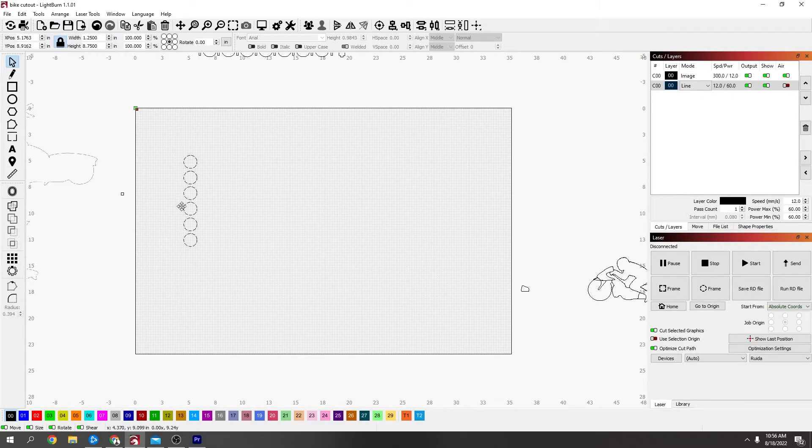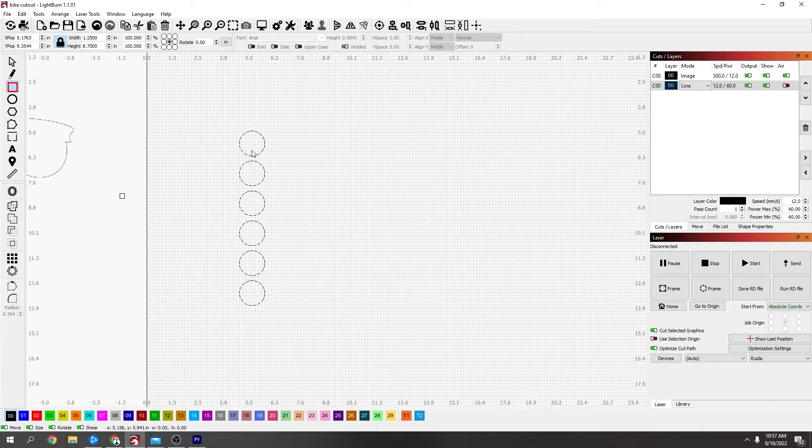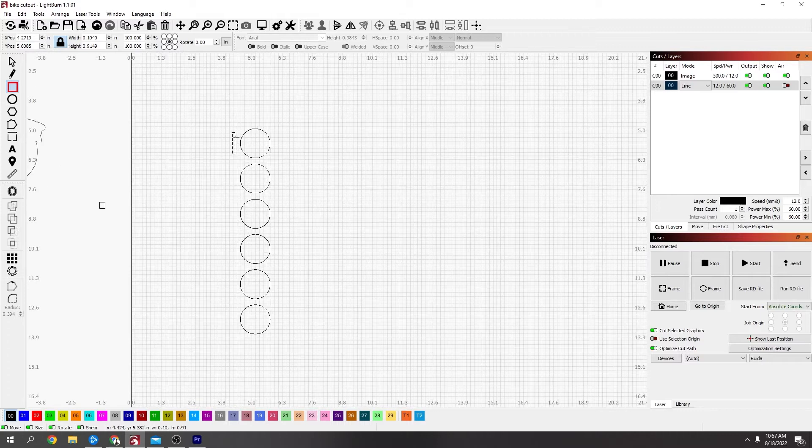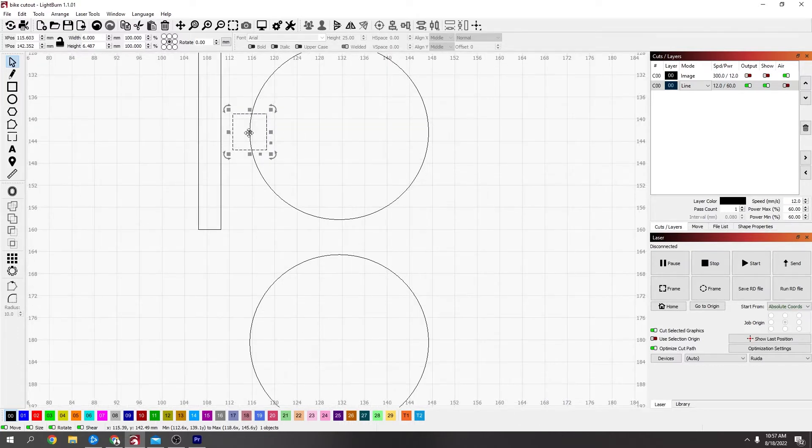Select these and bring them down to the laser. Now you need some tabs to hold the front and back apart and to keep the chips in the correct columns. Drag out a tab — I'm going into millimeters and making this tab four millimeters wide, which is how wide my wood is. The length doesn't matter too much. Down here is just a six millimeter square to check my spacing.